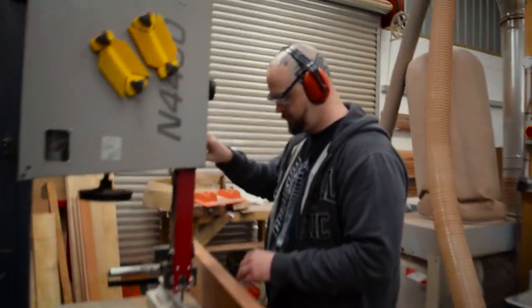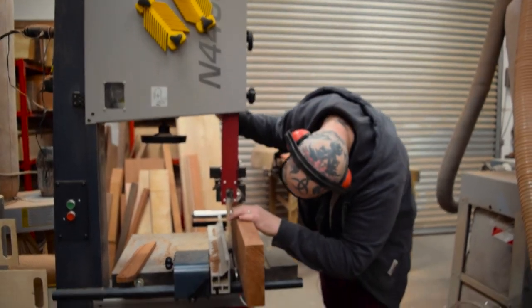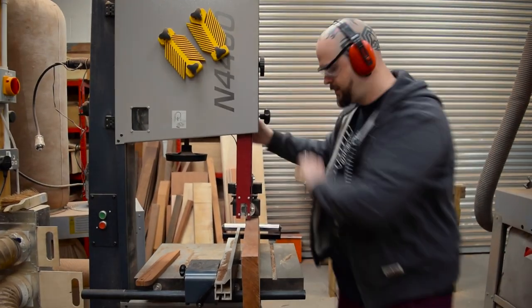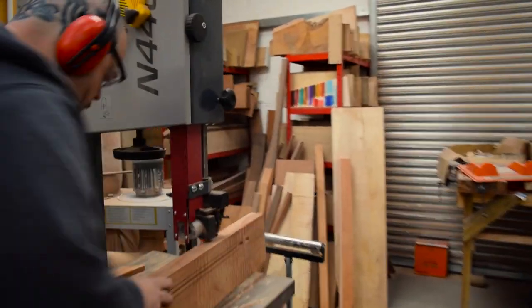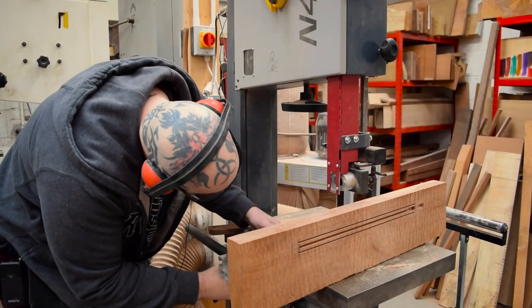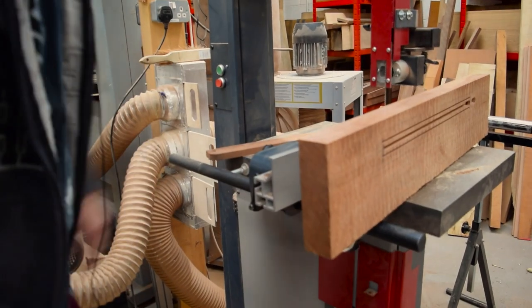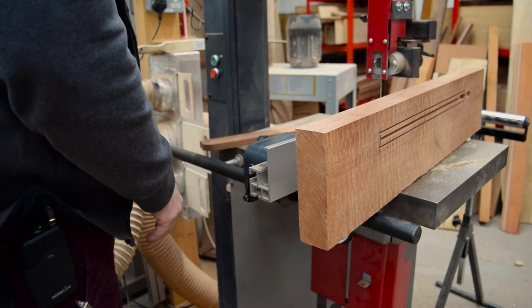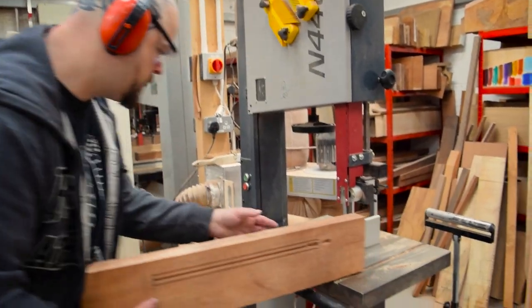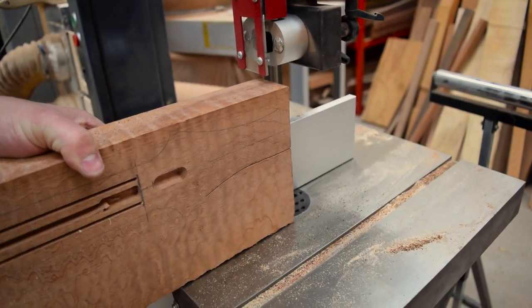Now, I had planned on making the back plates in the same way in which we make, that was a bad sentence, the back plates for all of the rest of our instruments, in a matching timber that matches the neck. And in this case, I thought, well, I've got a very thick neck blank, I'll cut a veneer off 5 or 6 mil and use that. But by making two cuts in it already, I've limited the space I have. It worked out in the end, but I got the order slightly wrong.